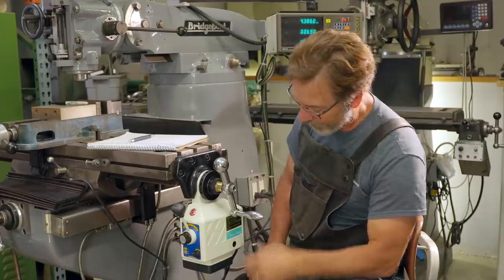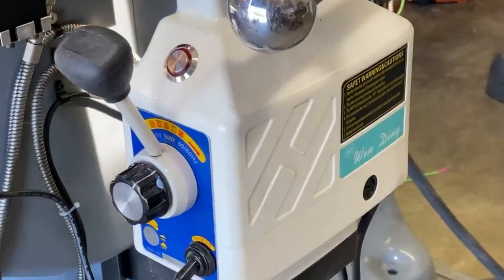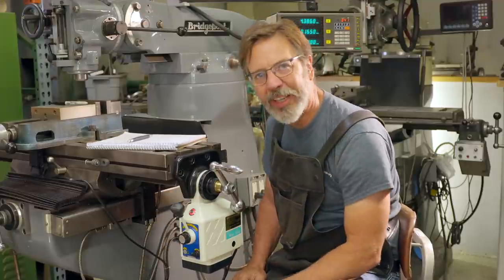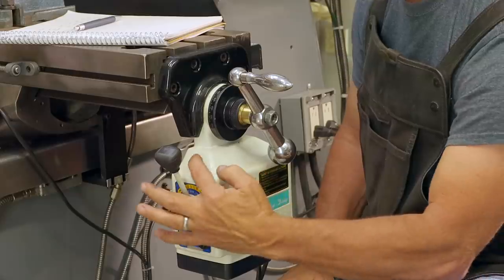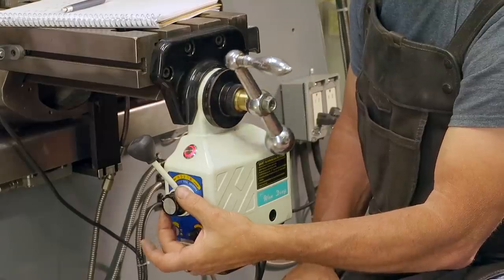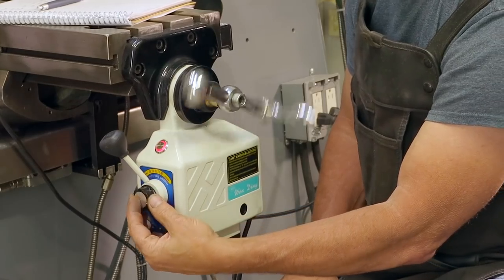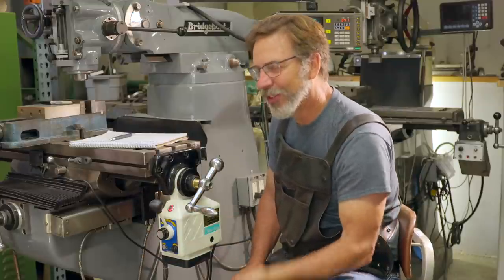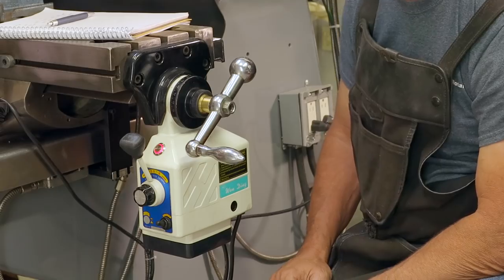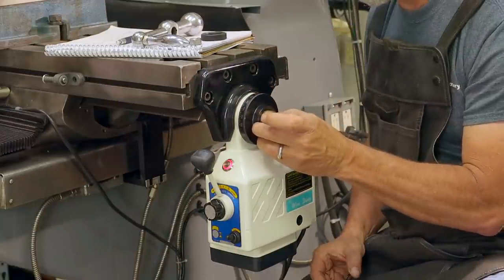Let's take a look at the cheapest power drive. This is the Winding — I can't make this up, the name of it is Winding. This is the cheapest one, it cost me about $100, there will be a link below. When you hit the handle, it's good and solid — the Rapid Traverse button feels just fine. One shortcoming is speed control: it's just a little slow when you bring it up. It stops at more like 5, so you can never take full advantage — they have the wrong potentiometer in there. The fit and finish is okay, not amazing. This knob is actually plastic, not steel.